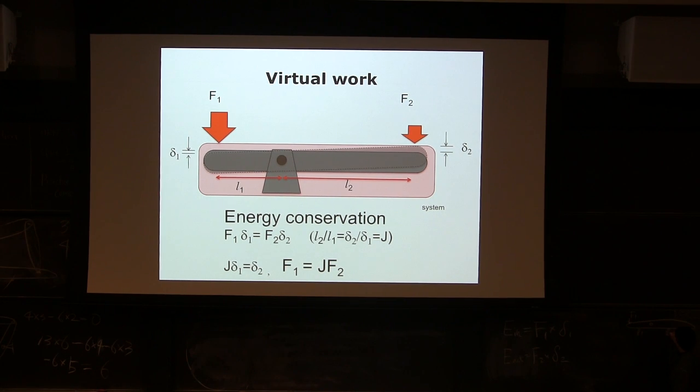This is L1, L2, and then you want to measure how much force I'm resisting. You can just do the moment balance about O. Taking the positive part, F1 times L1 minus F2 times L2 should be 0, because you have to balance the moment. This is a positive moment, this is a negative moment. So if I want to know F2, it is F1 times L1 divided by L2. This is how you get it, right, if you use a free body diagram.